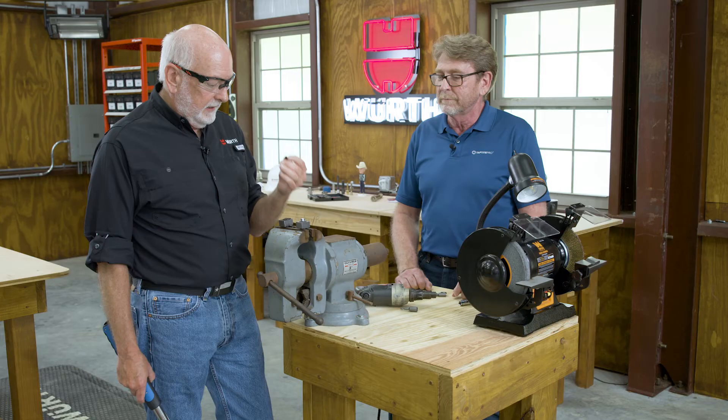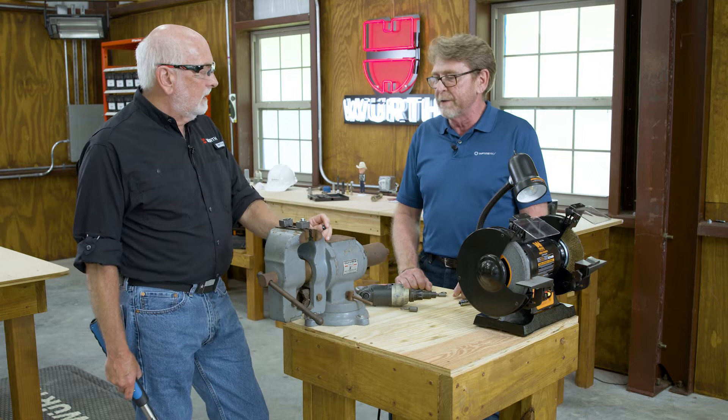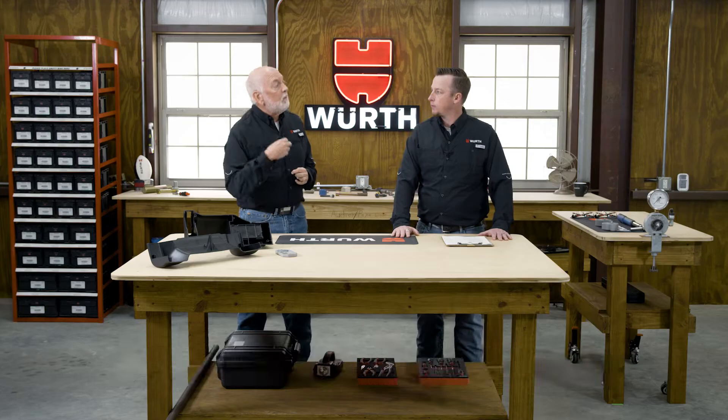Failure mode of fastener fracture — that's what we're looking for. That is a game changer. A big thank you to Ed Hebert and Don Falsman from Remick — excellent new technology, they did such a great job. Now remember with plastics: you have to make sure you use the correct screw for the right material. And minimize your torque, not maximize. That's all based on your flexural modulus.